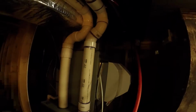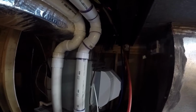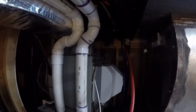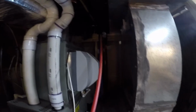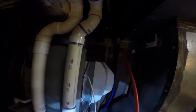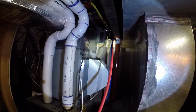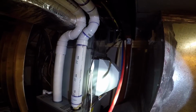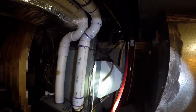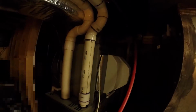So this will get the best hot water, and probably set it up also on a smart switch, 110 volt smart switch using a relay. And set it up so that in the summertime I can manually control it, because I don't really want these lines just sitting with all that water in them all summer, you know, getting stagnant and all of that. So I'll set it up on a regular smart switch and put it in my SmartThings and just tell that switch to run for 5 minutes every day or something, and just let it recirc. You know, I mean, it's really just recircing with the tank, so there really won't be a loss. This won't be on, won't be pulling from it.